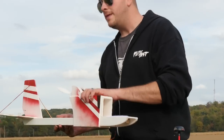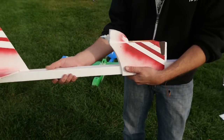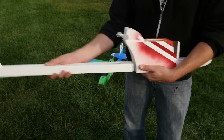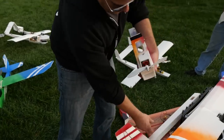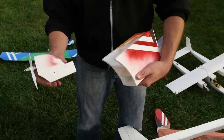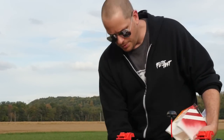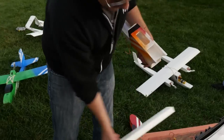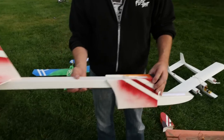The idea of using the main core is you can actually interchange, stretch, change proportions, change dimensions, and change CG. To do this, we made this adjustable — it can extend or contract, or be completely removed and swapped out for something different. Along with that, the power pod comes out too. You can switch out power pods, have more than one, have a bigger or smaller motor, and since it's the same proportion, you can actually study the effects of moving things around.